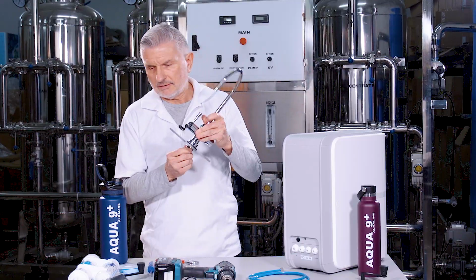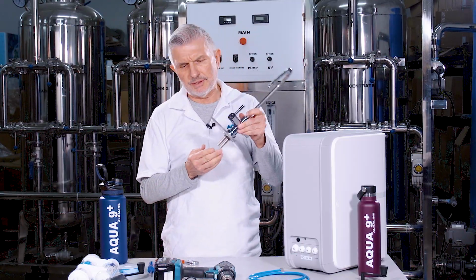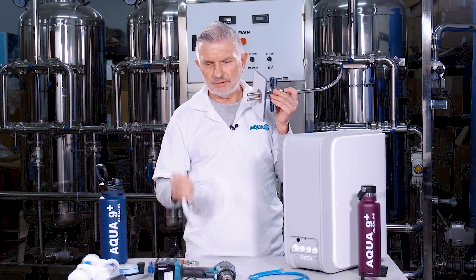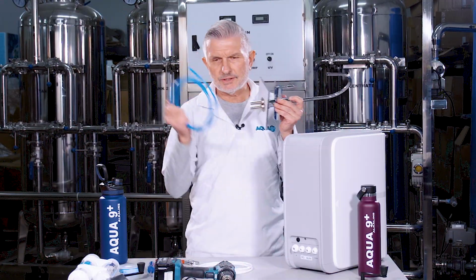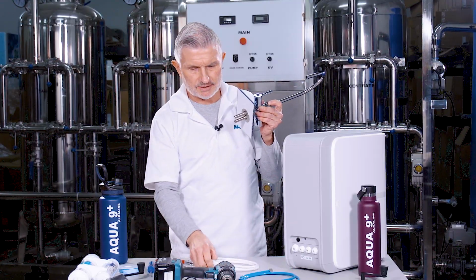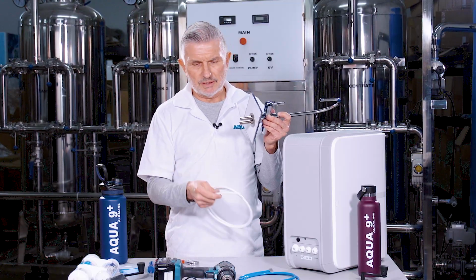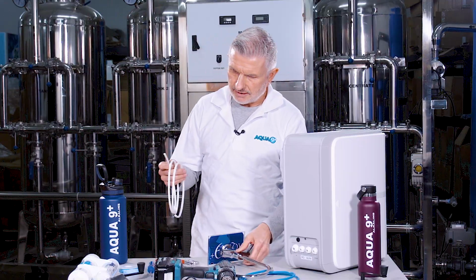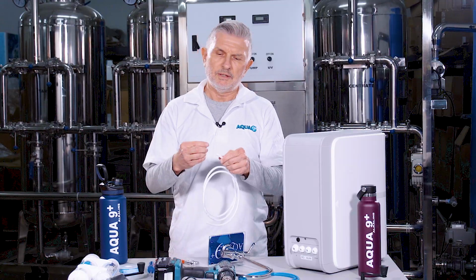So once you got that faucet mounted onto the sink deck, what you need to do is install both the reverse osmosis line, the 1/4-inch white line, as well as the 1/4-inch blue line for the alkaline side of the faucet. For demonstration purposes only, I'm going to go ahead and just do the white one because it's going to be the same for the blue one. So what you need to do first is you take what comes with this whole kit.